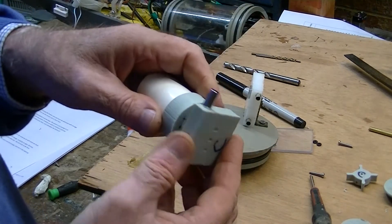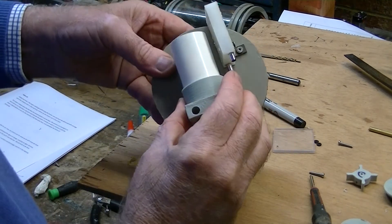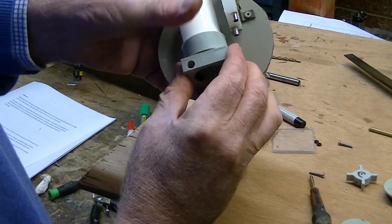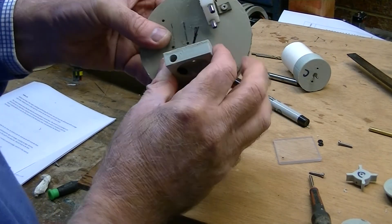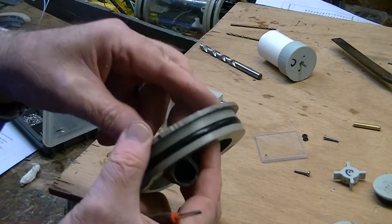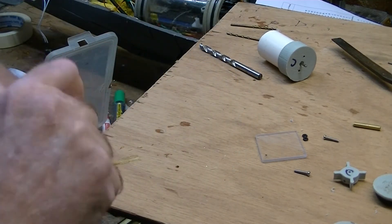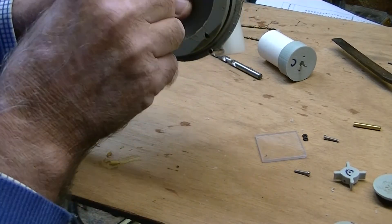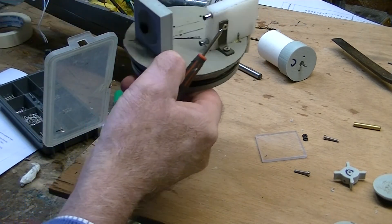Let's look at how it's going to sit. It's going to sit like that, and I want to put a screw in here so that when I fasten all of this on, it screws into the top. You can see why I'm thinking about doing this before anything else — let's get this right and then we can proceed. I drilled a little hole through there and a little hole through there and they now happily meet together. When I put this on finally I'm going to have epoxy in all of these little holes and running all the way along the side, so it will fit in there quite nicely, pointing in the right direction.